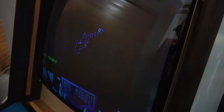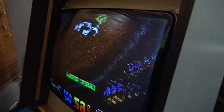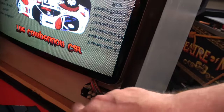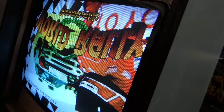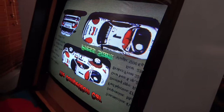Okay — the flyback is up, but I can't believe it — the picture is back to front and upside down. Murphy's Law! But it works nicely. I still need to bring the picture up a bit more and adjust the controls on the front. There's actually a pin cushion adjustment on here, and having the control box at the front is awesome for doing adjustments. However, when I get the width to minimum I'm still losing a little on the sides. We had it on M1 — maybe we need to put it in M2; that might give a little more width. Let me go research that, and of course we've got to get the screen the right way around.